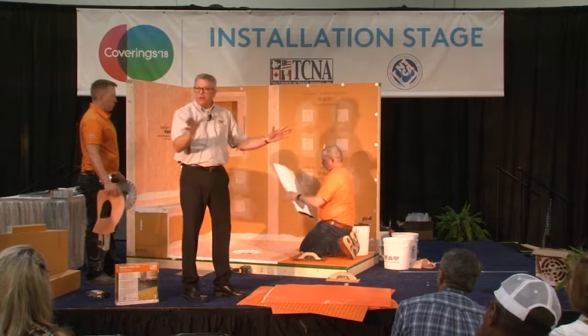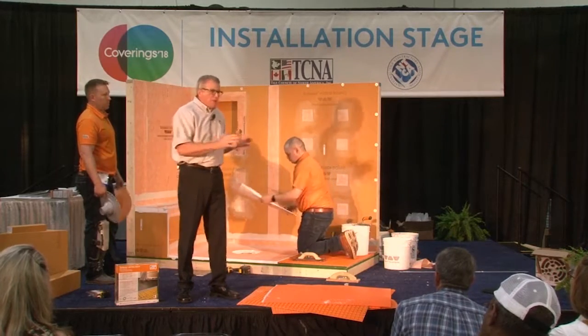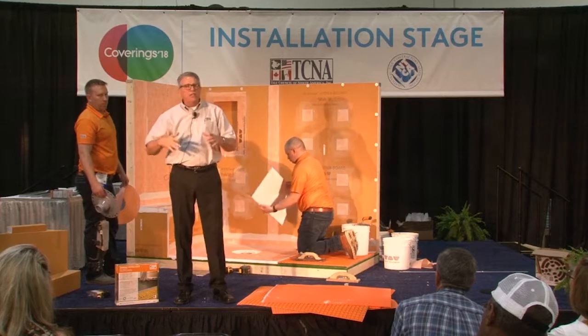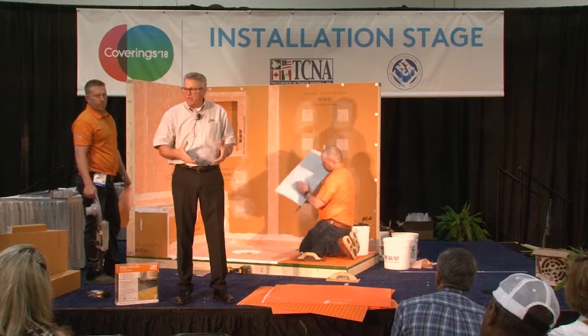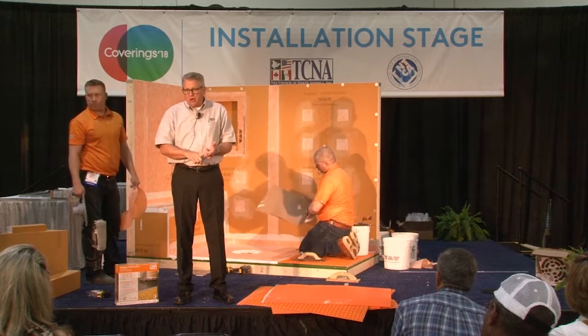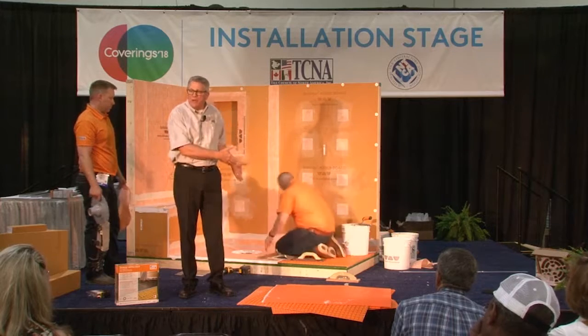All right, so there's all your DITRAs. They've rolled out through the last years and so forth. So when you think about your DITRA, think about what is it you want out of your floor? What kind of performance do you need that floor to give you? Uncoupling? Certainly. How about waterproofing? Like here, where we're doing a bathroom when we have OSB.